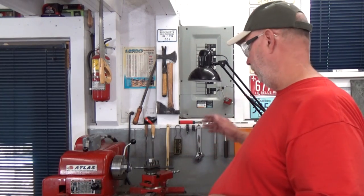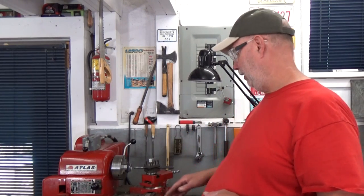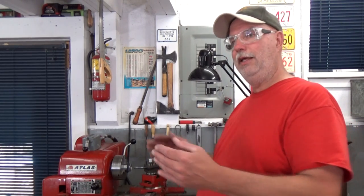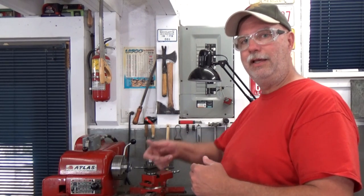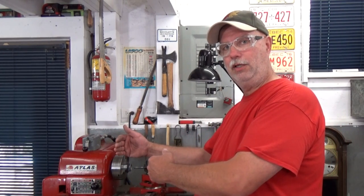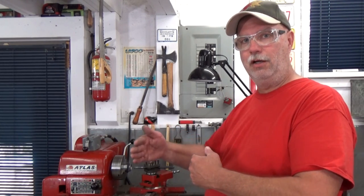For the rest, while we're cutting from the tailstock to the headstock with a counterclockwise rotation, so it's a right-hand thread, and while we're going to be cutting in the same way, my compound rest is always going to be moving forward, and my cross-slide axis is going to move in instead of out, in to clear the thread, come back to clear the part, come back to zero on the cross slide axis, take another cut on my compound rest, take that cut, back out with my cross slide axis, come back to clear the part, return to zero, take another cut on the compound rest.